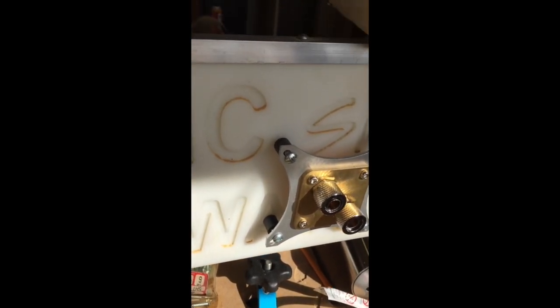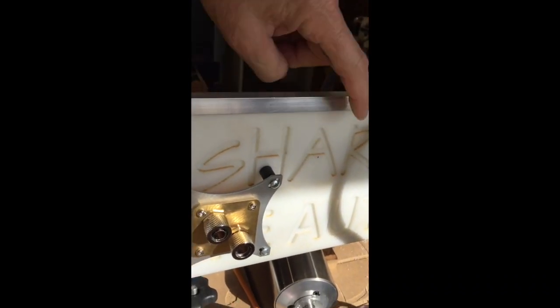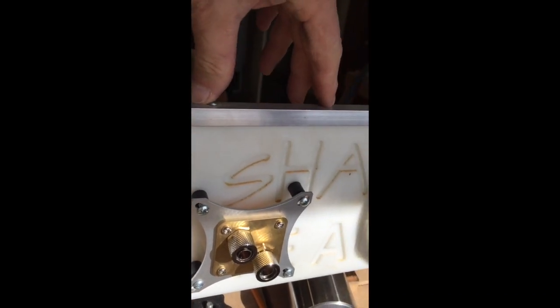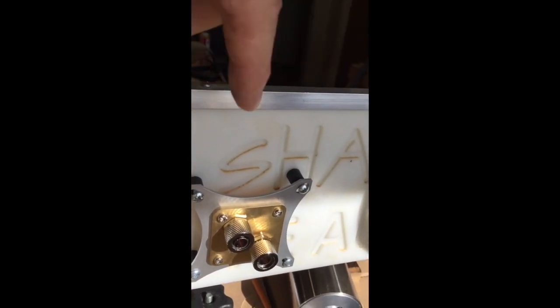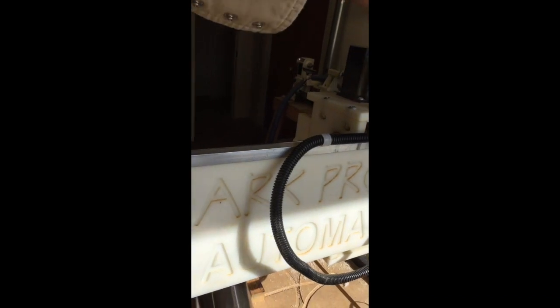Next I'm going to mount the pump right here. That mark is the center of this gantry, which allows me to have shorter hoses — if I move it all the way to either side I'd need longer hoses. This is a 33-inch gantry with 24 inches of movement, so mounting the pump at center means hoses only need to reach 12 inches each way.